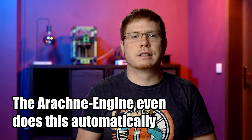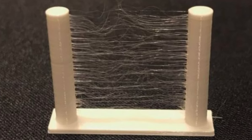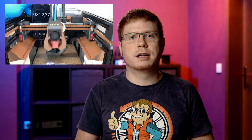Especially if you're using tweaks like a wider extrusion width in the slicer, you don't even need a larger nozzle for this. On the negative side, the longer tube has quite a bit of slack. That means retractions — where the extruder pulls the filament back to prevent oozing — need to go for a few millimeters instead of sub-1 millimeter for direct extruders. This makes printing flexible materials like TPU quite a bit harder. Bowden extruders are also susceptible to stringing. They are most prominently present in cheaper printers, though there are quite a few high-quality printers with Bowden systems as well. At world record printing speeds there's no way around a Bowden system, but if your printhead is moving lightning fast, there is virtually no need for retractions anyway.